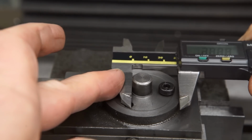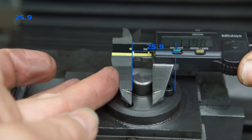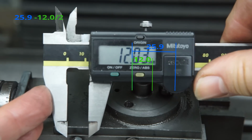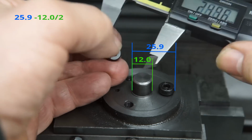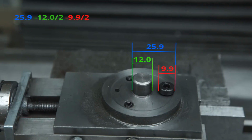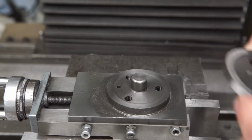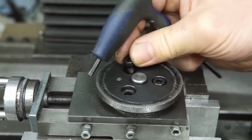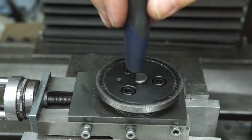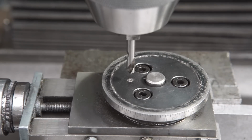As the bottom disc is attached to the cross slide only by 3 M6 bolts, I intended to add 3 bolts to stabilize the mount. The bolts should be located approximately on a circle. The radius was determined by a few measurements. The bottom disc was mounted to drill the holes for the bolt circle. The DRO was used to locate and center drill the holes.